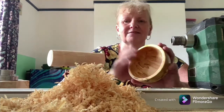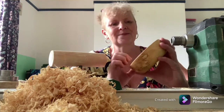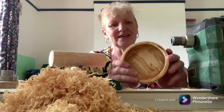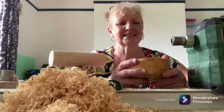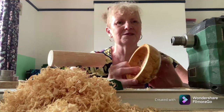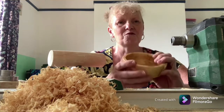Wood shavings again — I've got some fine dusty stuff as well but I've got lots of curly ribbons, so I was pleased with that. It's the wood, not my chisel on this particular occasion. It's a gorgeous bowl — I'm really pleased. I struggled on with it and fought through its challenges. I think it's one of the favourites I've made so far. It's really nice. I left it a little bit thick around the edges, mainly because of the tear-out problems I was getting on the outside, so I didn't want to risk getting too thin and causing problems with the overall bowl.